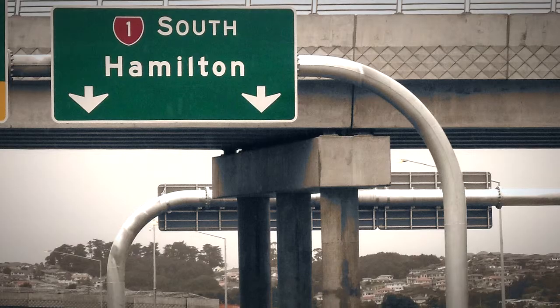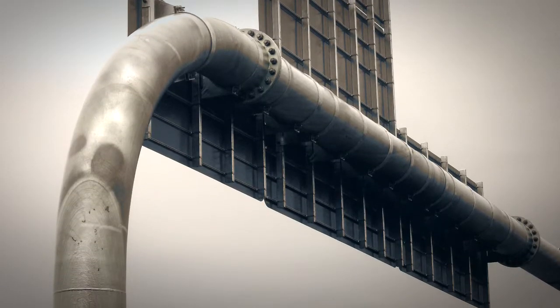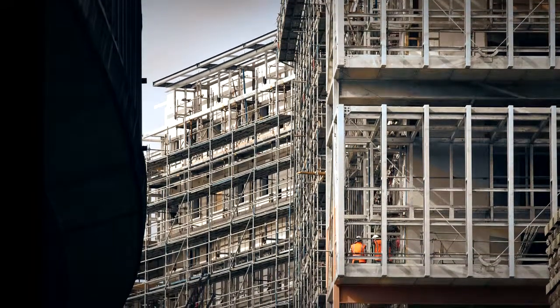As we know, any damage to a paint coating will allow rust and corrosion to develop. With galvanizing, however, the zinc barrier is at least as thick on the corners and edges as the rest of the item. The zinc corrodes in preference to steel. It effectively sacrifices itself to protect the steel. And because zinc is anodic to steel, the galvanized steel provides cathodic protection to any exposed steel.